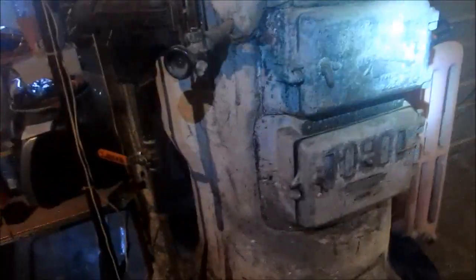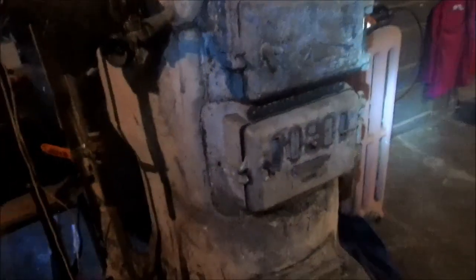This is probably the oldest boiler I've worked on. It's got a bad bi-metal switch — if the pilot drops, it doesn't allow it to fire. It's a safety device. But yeah, it's running. It's running safe, believe it or not. The thing's just a serious gas hog.